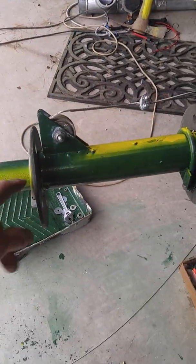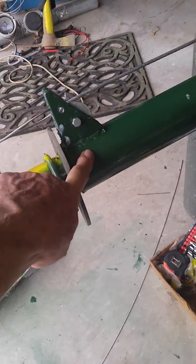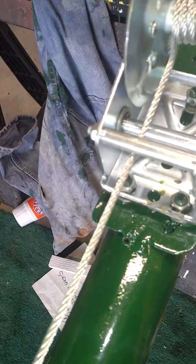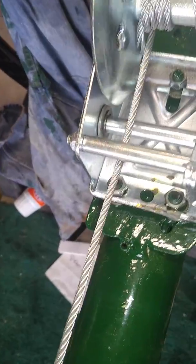I have it pretty much fully collapsed. This clamp is against the second pipe, this clamps against the first pipe. What I've done is set it up so you can see what happens when you start to crank it — it's got a lot of mechanical gain here. It looks like maybe 30 to 1 on the pulley. As I crank this up, you can see the cable moves fairly slowly. So it goes up really slowly.